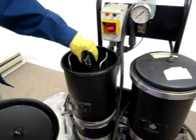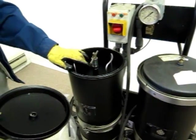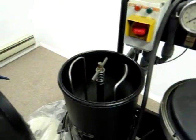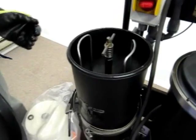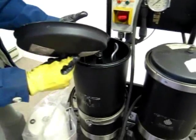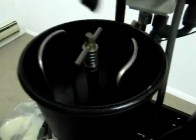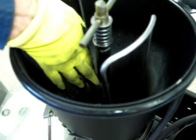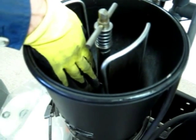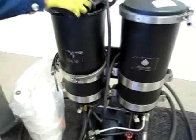It's really important that the washer be watched because a bad washer will allow dirty oil to bypass into the discharge hose. The oil flow direction is: oil comes in from the outside, filters through the media, goes into the center of the element, and is picked up by the tube inside. There's a hole in that tube where the clean, filtered oil is returned and flows down the pipe into the discharge hose and back into the equipment.